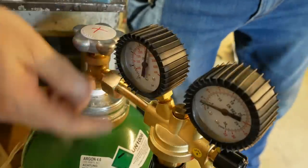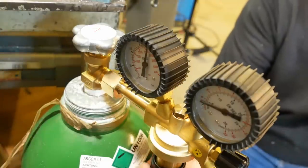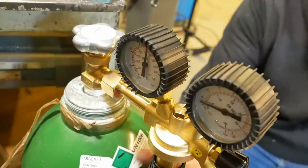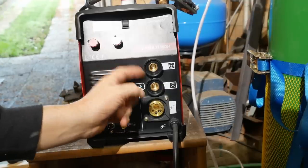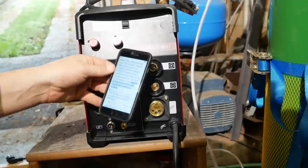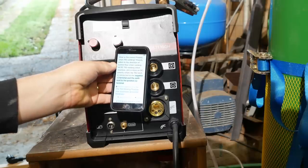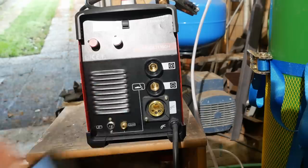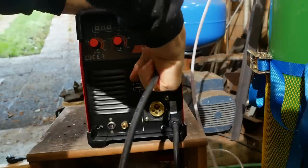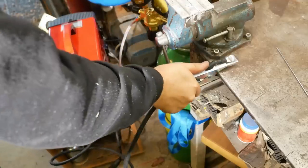Okay, well that's not leaking — that's good. Looks like I can't set it until it's flowing, but there's no flow through the welder either, so there must be some sort of functioning gas valve in the welder. Okay, for DC TIG do I need ground positive or ground negative? What does the internet say? All DC TIG welding is done DC polarity where the torch is negative and the earth is positive. Well, here we go then. Quite short leads on this machine — only about a one and a half meter earth lead.